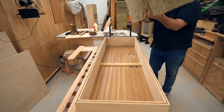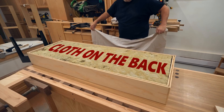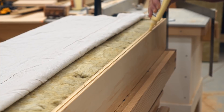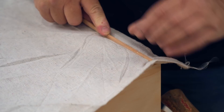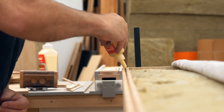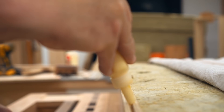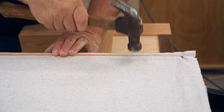With that done I could get the rock wool put in. I've got the panel sitting on the bench face down. I want to do the backs first just to get some practice in — I figure by the time I get all six backs done I'll be good enough to do the fronts. I put some glue in anyway, figured it couldn't hurt. It took a little trial and error to get the size of the spline right so that it goes in and pulls the fabric in without breaking the plywood apart. This was the wild card in this build — I really wasn't sure if it was going to work. This is very similar to how window screens are put together: as the spline goes down into the groove it pulls the fabric down with it and makes the cloth nice and tight.